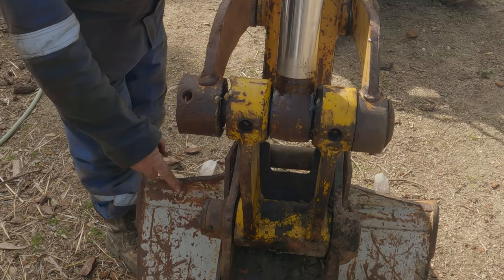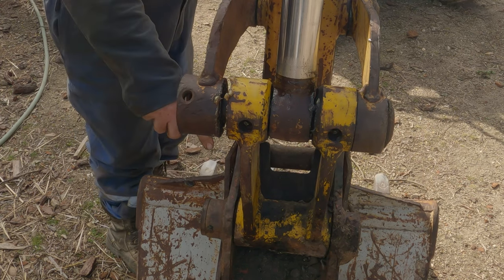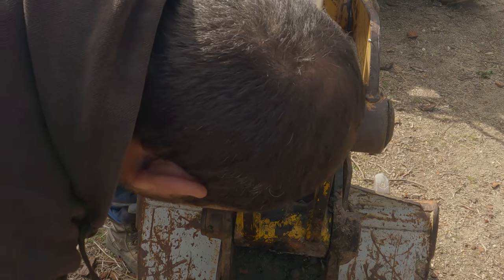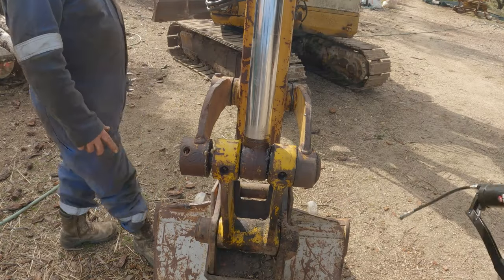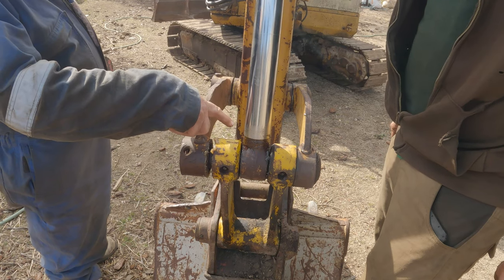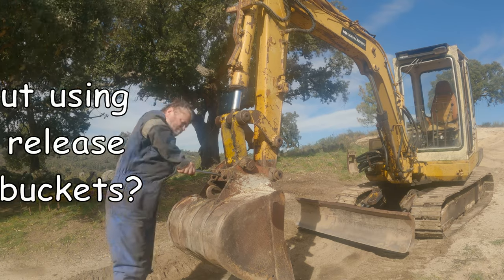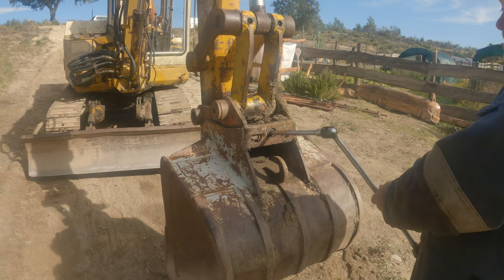The point is that when you grease up before you start work you should actually see a certain blackness around the joints — dirt sticks to the grease and that's what you want to see. If you're not getting any sign of dirt or grease sticking there, she's not getting grease. Also, if you buy a machine and you go around and find a grease nipple you can't get grease into, that suggests the last owner couldn't get grease into it either — it's of major importance that you get something done with that to see what the score is.